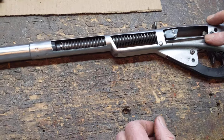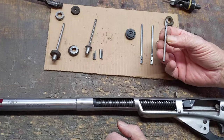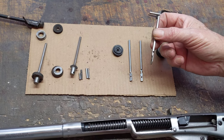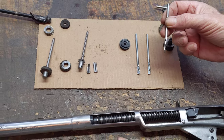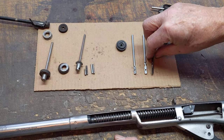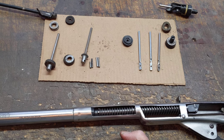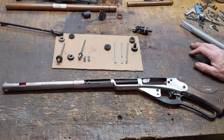So where we're at today: we've fabricated a thin wall stainless tube with an incredibly fat bore and it does not give us more air. I think the mistake I made was going straight to drilling a dual port — I should have made a single port design first, gotten numbers, and then gone to dual port to see if there was a change. The end result is I'm going to fabricate another one and stop at the first hole to get those numbers. Right now I don't see an improvement with the dual port design for my applications, although Jonathan is seeing quite a bit. Go check out his video — it's got some impressive numbers. This is Shane Bruce with Resto-Ma Daisy, signing off.